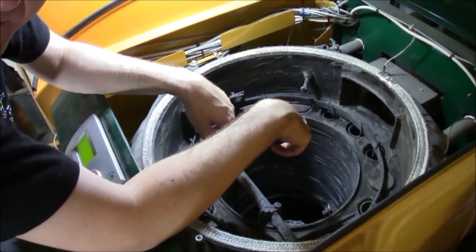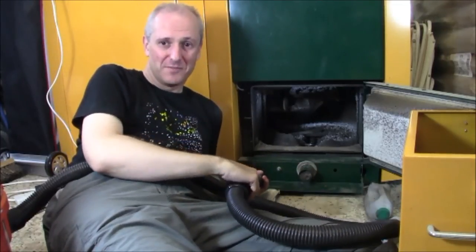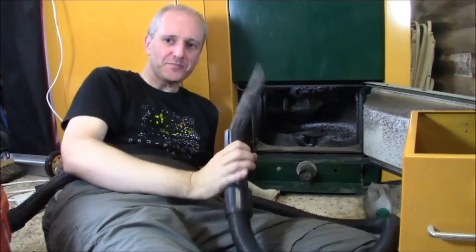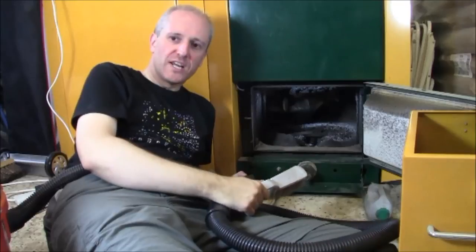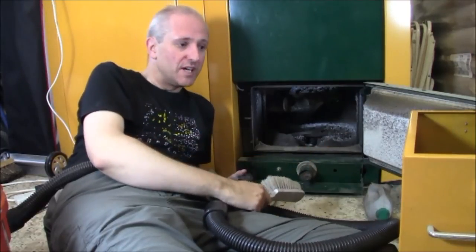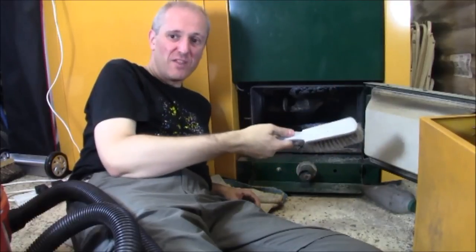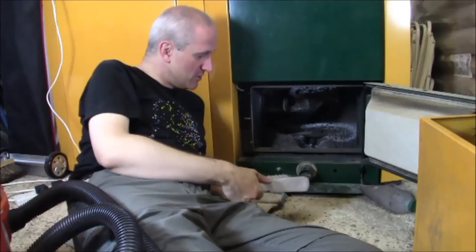What we're going to do now is go down to the bottom and get a bit dirty in the burn chamber. So here we are on the floor of the garage. You have to accept that if you're going to clean a boiler out, you're going to get dirty. Put your dirty clothes on and put something comfortable on the floor — some foam sponge, some towelling, some old sacking. You're going to be down here for about ten minutes, so get comfortable. Arm yourself with a vacuum cleaner and a soft brush and clean around the entrance area. Take a stiff brush and brush everything down — that'll dislodge quite a lot of dust — then go around again with the vacuum cleaner to tidy up everything you've dislodged.